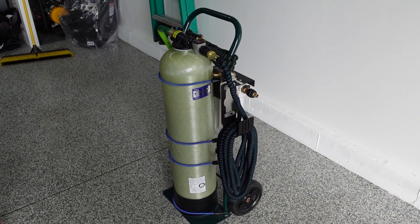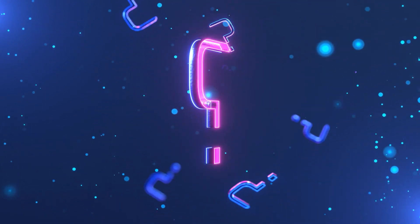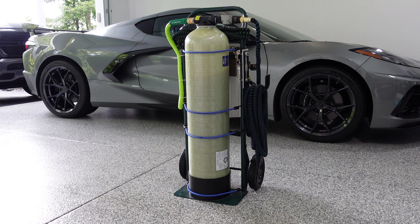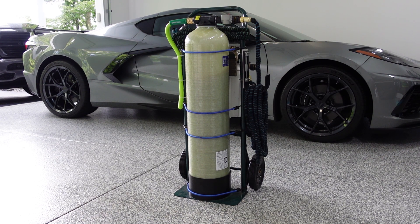Anyone can put this together — aside from filling the resin tank, you're basically just screwing in hoses. Is it worth it? Two years ago the system was actually cheaper to build than it is today, so from a cost perspective it was absolutely worth it. Today, the costs between the pre-builds and building yourself are so close that it really comes down to the other factors — mainly the flexibility and capacity of the system. If you want to incorporate things like pre-filters or simply have a lot more resin in the tank, then building your own will always allow you to get exactly what you want. One potential downside of going with a vendor is lock-in — especially with a filtered system, you'll only be able to buy filters from that specific vendor, and pricing and availability may fluctuate. At least on a DIY system, as long as you can get resin, you're good to go.